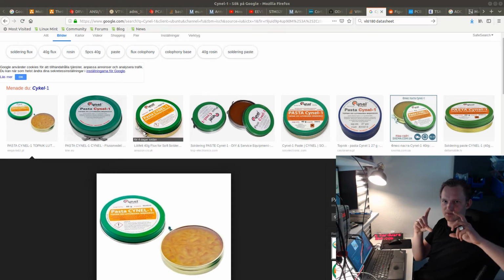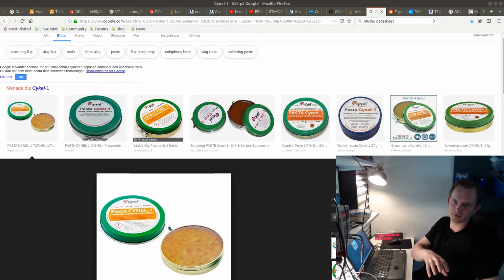And I put that filter in the back of this vacuum cleaner, so that the air actually goes through the bag of all the dust in the vacuum cleaner. So that kind of gets rid of some of the particles. And then there is this coal filter, and then the ordinary filter that is in the vacuum cleaner. And I find that this does a pretty decent job of sucking out all this smoke that comes up when I start soldering. I probably need to have it a little bit closer to my work area here. I moved things around, so I need to make sure that everything is closer together, so I get really nice airflow directly into the opening of the vacuum cleaner. And I need to put some net on the opening, so if some component decides that it wants to fly into the vacuum cleaner, I can just catch it. But I think this is a decent solution.